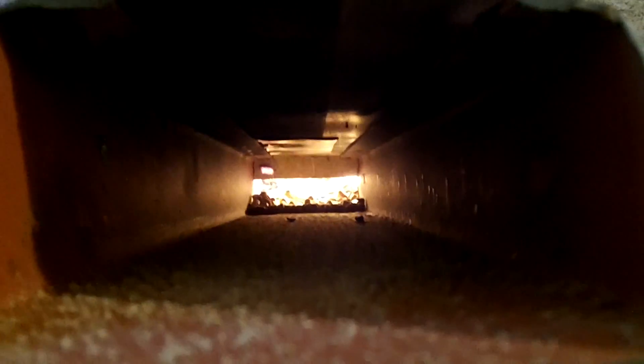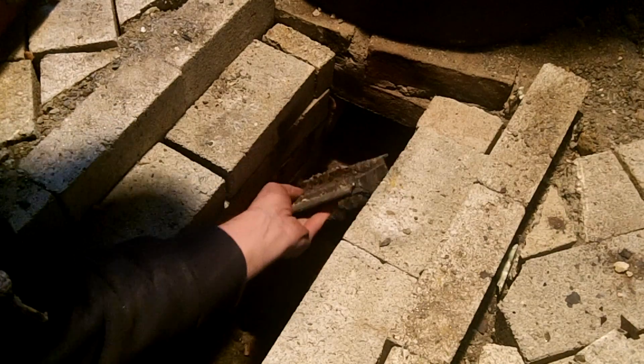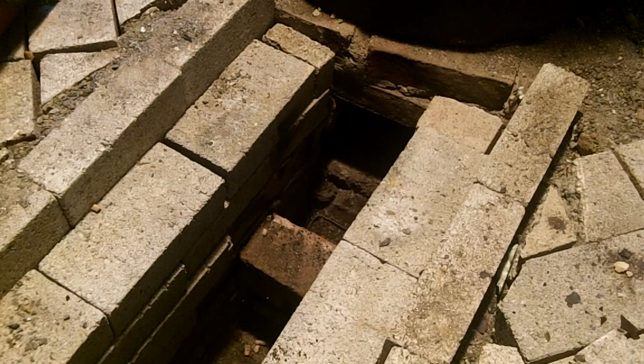This is looking down through the hopper after the pellets have burned, but there are still some embers burning on the grate. Air is also drafting through the hopper, so there is nothing backdrafting through it. After the system has cooled down, there is hardly any ash left on the grate. Any cinders that were in the ash tray have burned off, and I'm left with fine particles.